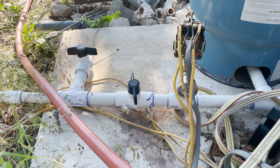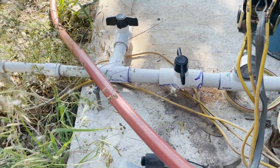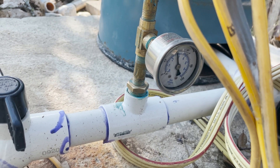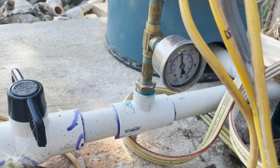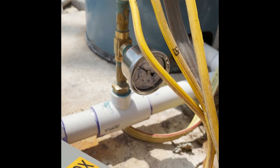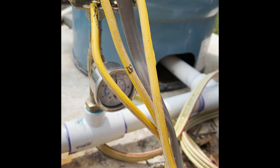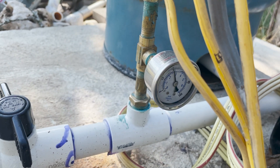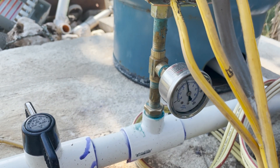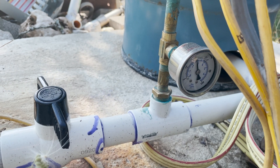One important point before we go check the water fill on the storage tank: I turned off the valve that feeds upstream to the tank, so at this point we're not short cycling. We've got pressure, holding at 60 PSI — which was not the case before. Previously this thing was cycling — click, click, click — pressure would go up to 60 PSI then drop, go up, drop, go up, drop. I don't know if the pump wasn't running or if the bad capacitor couldn't start the pump properly. But bottom line: we've got pressure, holding at 40 to 60 PSI, and I think the pump is actually working.